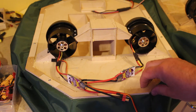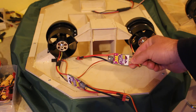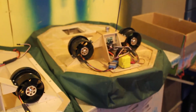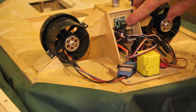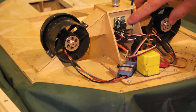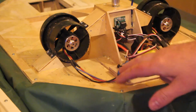I don't want to go too deeply into that because I'm going to redo it with an Arduino board and add more features, since these speed controllers can do reverse and I want to include that. But for those who are interested — here's one I did earlier. What you've got here is a little circuit board with a PIC 12F675. That does all the mixing. It's got three inputs: the two from the receiver and a pot which does the hover height, and then it gives three outputs to the three speed controllers.